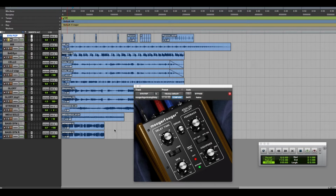We've got a reason for using those, though, instead of a normal hi-fi echo, and that's that most echoes off a canyon or a basketball court are a little bit degraded in fidelity. There's something very musical about that. The repeat is not exactly the same sound you put in, but a bit degraded. And certainly that's one of the artifacts of the old bucket brigade chips that were used in these pedals. Let's look at it and show you what it does in a very simple synth sound.